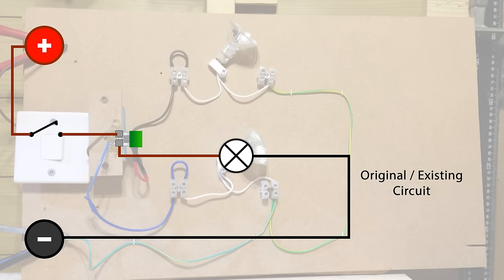The problem is on my particular setup the colours are a little different. So if we add the colours there you can see what I've done. The positive comes in as a blue cable and it goes out as a green — so think of the green cable as the earth, by which I mean the negative, the chassis of the vehicle itself. Obviously this existing circuit already has a fuse — it's got a green fuse.